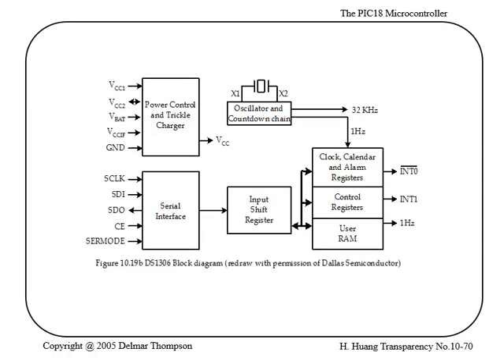The block diagram is similar to what we've seen with previous chips. You have your serial interface connections — clock, enable — and chip enable, which is similar to the SS-bar we've seen in previous devices. Whatever is communicated goes through the input shift register into these registers. There are clock and calendar registers, control registers, and user RAM for custom design stuff, plus trickle charge for the battery, which we're going to skip.